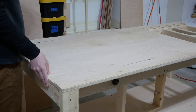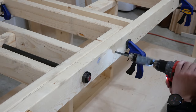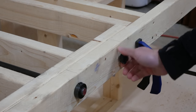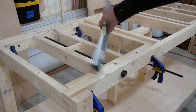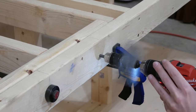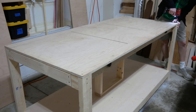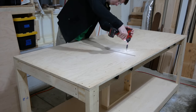I aligned the rotating top flush with the rest of the plywood and clamped it in place. I then drilled a hole in the side of the workbench — first with the drill guide, then enlarged the hole on the back side of the rotating top and screwed in a threaded insert. This allows us to lock the top in place using a threaded star knob. We need to lock the rotating top when the underside is up as well, so I flipped it over, made sure it was level, drilled a hole through the rotating top using the existing hole as a guide, and added another threaded insert. I then added the main plywood top of the workbench, counter-sinking and screwing it in.